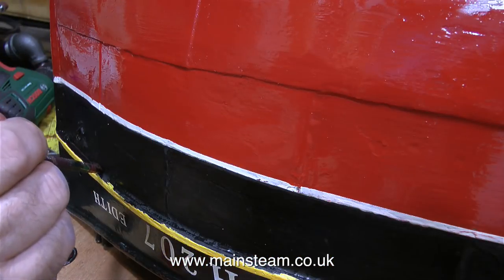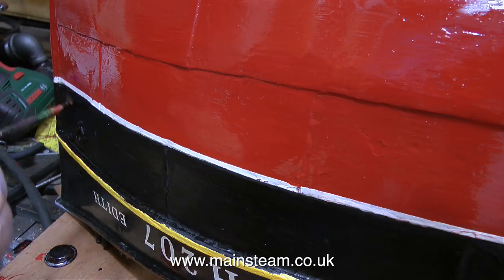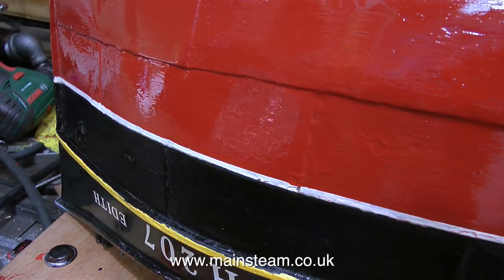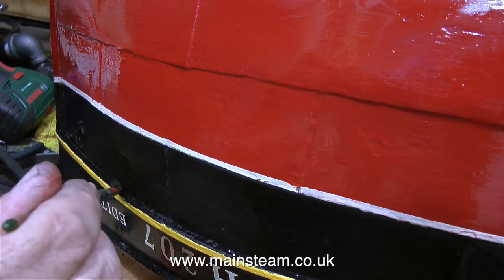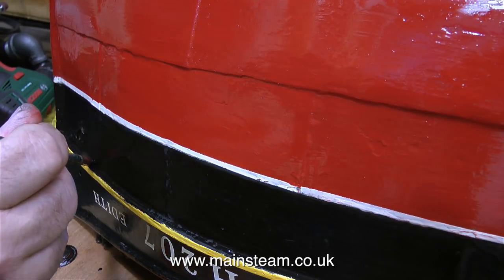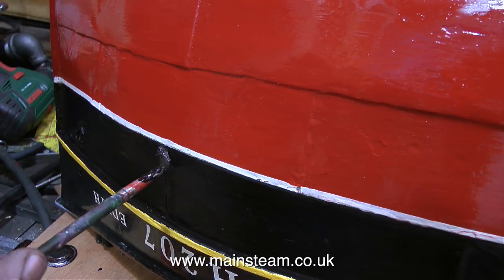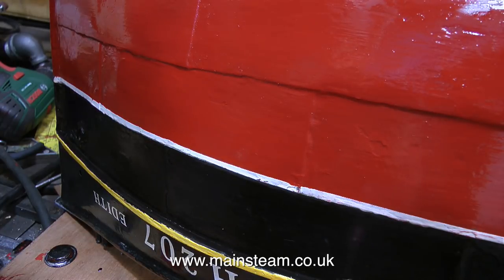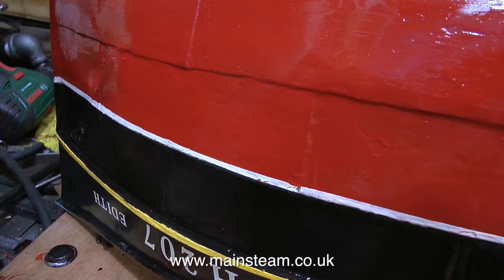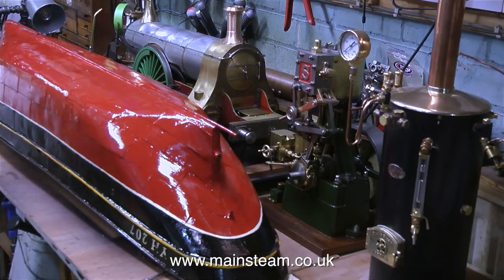This video is all about repairing the paintwork, not repainting the entire boat. Although the more I painted the red part, the more I needed to paint, because it didn't look right with the original red showing through against the really nice squeaky clean shiny new panels. Plus I detected one or two slight cracks in the joins between the panels — even though the inside shell is now covered in glass fibre with resin, I didn't want water getting in between the plates and rusting the metal from the inside. Currently I'm repairing the black paint, and with that I can just paint the parts that are damaged. That matches in quite well.